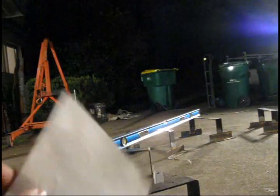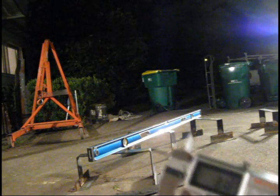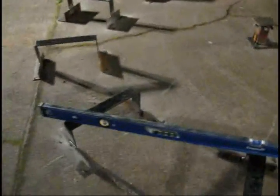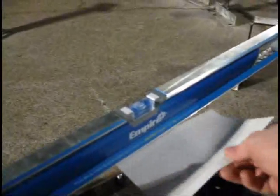This is a piece of card stock — everyone recognizes millimeters as being small — it is about 0.2 millimeters. So we've got this used as a straight edge right across here, nice and tight. Doesn't fit underneath. So we definitely have a flat surface.